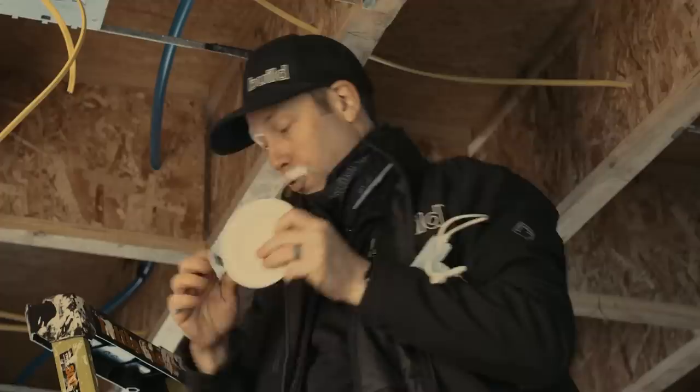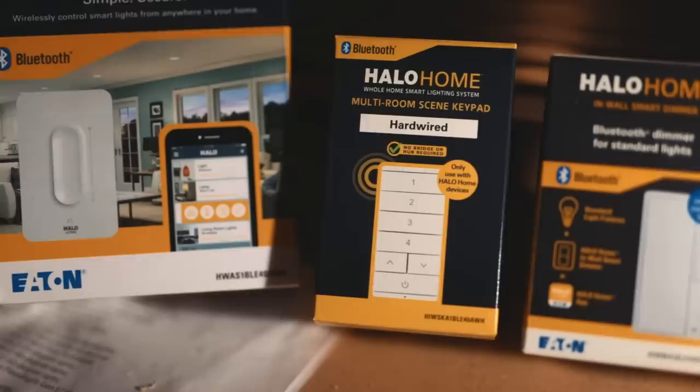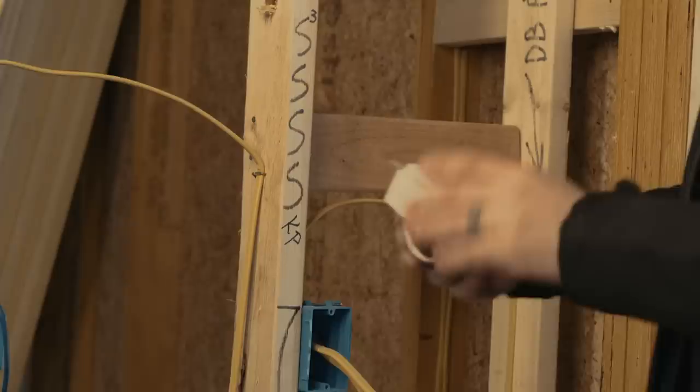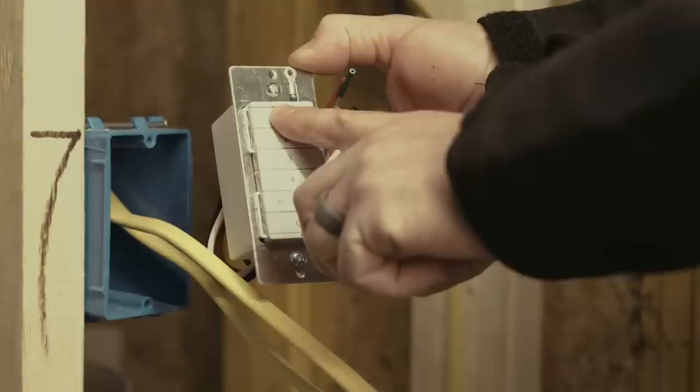While we're in the foyer here, let me show you something else. I mentioned that light switch — that multi-room keypad — being a real game changer for me. I wired the house a little bit differently to accommodate this. If you look when you come in here, I've got this single keypad right here and you see I've got a bunch of S's right here. Had I used a regular light switch bank, I would have had four switches in this location, but instead I wired just one location. This is hardwired, meaning power is going to it — there's no battery to replace. When I walk in my front door, I'll press button number one and whatever scene I set up, whatever grouping of individual lights, all those will turn on. I could also program button three or four to be party mode or I'm-leaving-the-house mode. And again, I've also got the all-off button — I'm really leaving the house wondering if kids' closets or bathrooms or bedrooms are on, I hit the all-off button and everything shuts down.